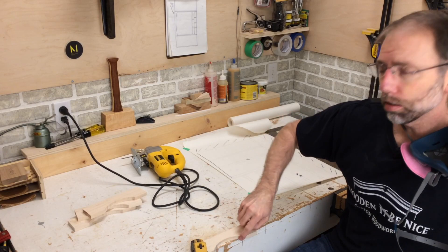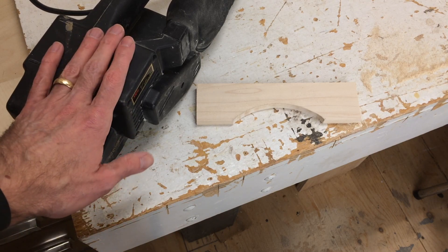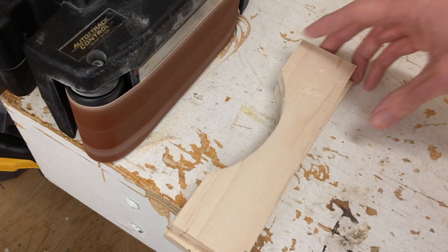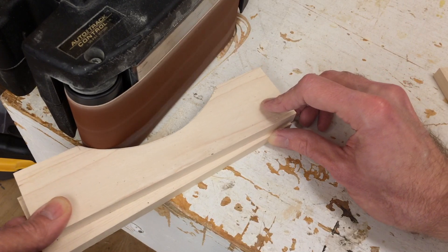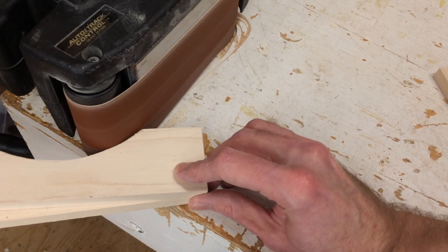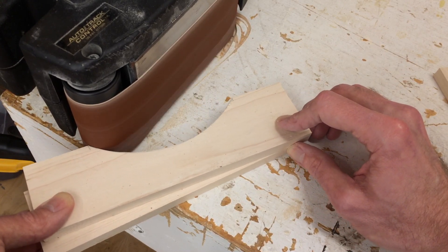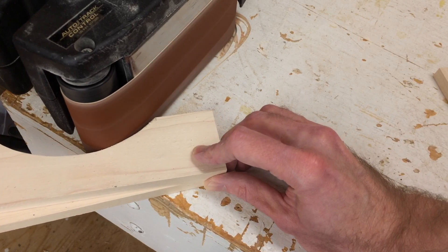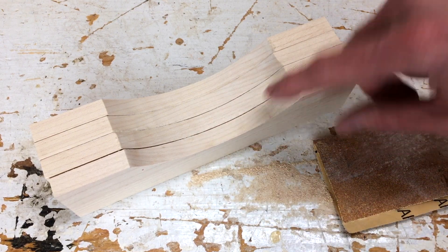With these pieces now cut, I need to sand them with the belt sander and get them all smooth. There are a few different ways to sand this profile: one is a spindle sander, another is a drum sander and a drill press, but more commonly people have belt sanders, so I'll show you how I clamp that to the work surface and use that. I use two pieces as I do this work — the bottom piece adds space between the workbench and the belt sander, and the top piece is what's making contact with the belt. I'm working towards a pencil line I left when I cut — I didn't cut right to the line with the jigsaw, I left just a little bit that I could sand off, and that way I'm getting the exact profile I'm looking for. I haven't sped this up at all because I want to show you how quickly this can get done. This is an 80-grit belt on maple, so it's fairly hard — I've done three passes and you can see it doesn't take very long. With these curves now smooth, it's just a matter of rounding over the edges with sandpaper and getting it ready for assembly.